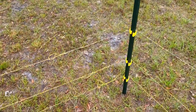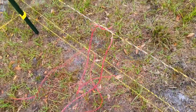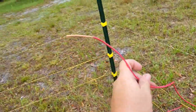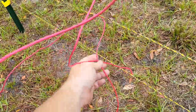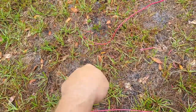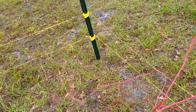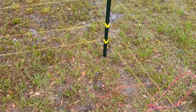Well as you can hear, it's raining again. But I got the three wires done. These wires over here are for hooking up to the charger. So this top one — that's a positive. Bottom one's a positive. The end here will go up to the charger and jumps and jumps. This middle one's a ground. So we have one end right here that'll go to a grounding rod that we're going to shove in the ground, and then this other end will go up to the charger on the negative side. That's pretty much everything — all we're missing is a ground rod and the actual charger itself.